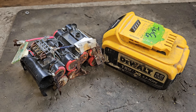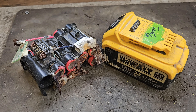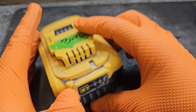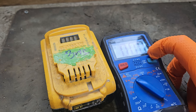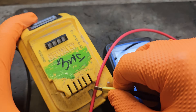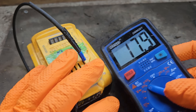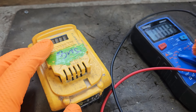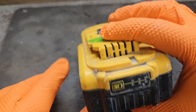Although you could say from looking at them that one is worse than the other, they're both as useless as each other right now. To identify the issue — it's not the charger, it's not powering the tool, even with those two bars showing. The first essential tool I use in the repair is a multimeter. I put the probes in the positive and negative terminals and I'm getting 17.9 volts, which is a perfectly chargeable voltage. We won't know fully what's going on until we get inside, but I'm willing to gamble that it is the board that needs replacing.